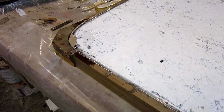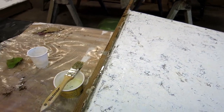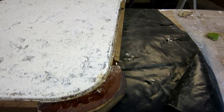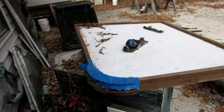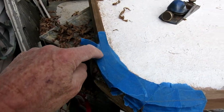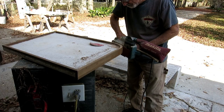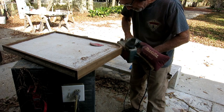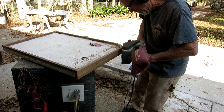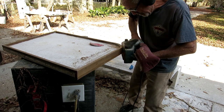Because I had to round the corners on the middle part so much to get the glass to roll over nicely, it left a big ugly gap around the perimeter behind the teak wood, so I just filled it with epoxy. Now I've got a bunch of cleaning to do when this epoxy sets. After a couple of days I did some rough sanding and rough planing trying to even up the edges and sketched the curve with blue tape so I can see the line better. I was hoping to cut these curves on the band saw but they were too heavy, so I ended up cutting them with the jigsaw, then belt sanding with a coarse grit to remove wood very fast.